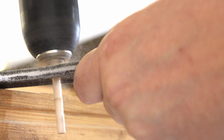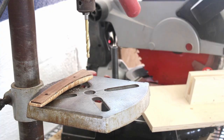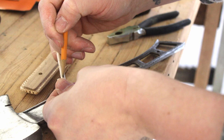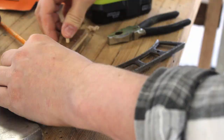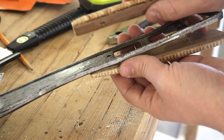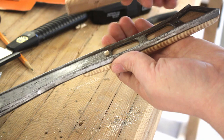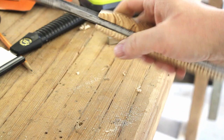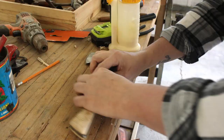Why do I need a dowel the right size for that hole? Because I don't want through-pins on this handle — I want it to look complete and uninterrupted. I love this pattern so much, so I'm going to do a captured pin with oak dowels. They're very strong. This is more of a hanging, showy piece; this handle will last a while if taken care of, but it is not an everyday workhorse farm tool. The dry fit is super tight — you can actually use the thing like this for a little while before the handle fell apart — so measurements are good and everything is nice.